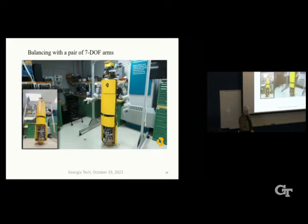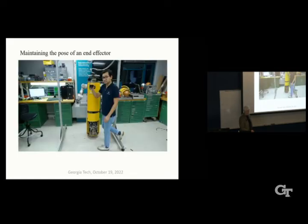And my student explored centroidal dynamics formalism, which is used for humanoids sometimes, for doing whole body control of the robot. That works pretty well in a simulation using Python, PyBullet, but so far it doesn't work that well on the real robot. There's a significant amount of unmodeled things happening in the robot itself. But we've been able to achieve a few things. The project is underway with three students now. We hope to converge on a method that probably will treat the arm motion as a sort of a feed-forward term for the balancing controller.